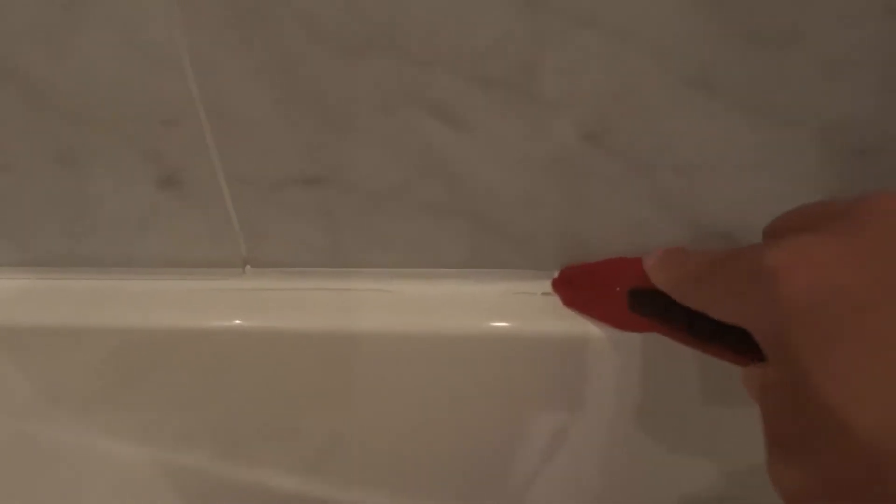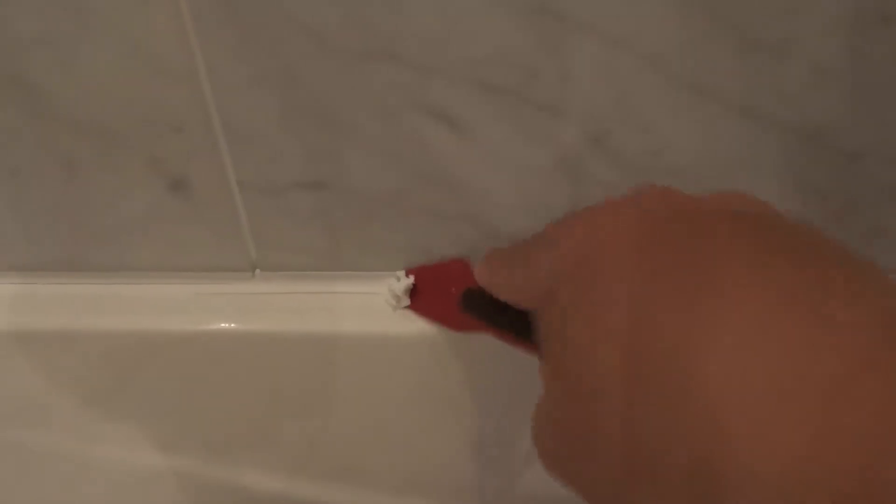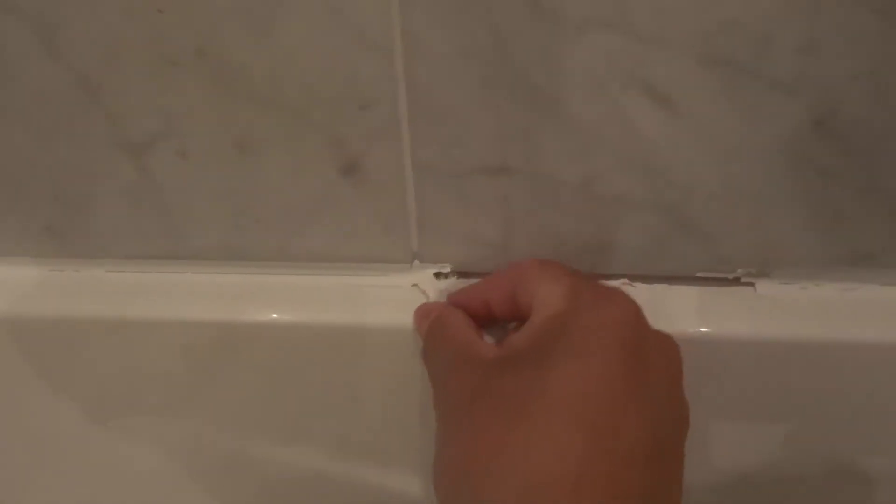So what you want to do is start off by removing the majority of the caulking that you see. I'm just going to get this tool right here, dig it deep down inside of there, and remove it just like that. I'm sort of wiggling my hand just like that, and the majority of the caulking is coming out like that. And then if you get lucky, you can even just pull it out like that. So if you get lucky, you can do a good amount just like that.